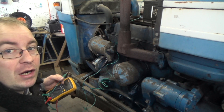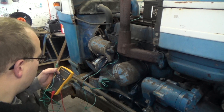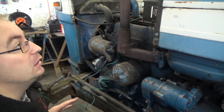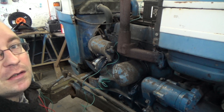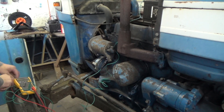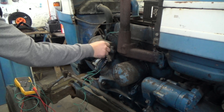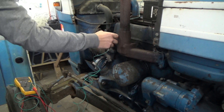Try to do it the right way, not hastily — just watch what you're doing and think twice. I'm going to start the tractor now. I'm going to turn on the ventilation in the shed so I don't suffocate from fumes. Checking that the leads are not in the way of the fan belt or anything else. Not too worried about the lead near the exhaust because it's not running long and it's cold.